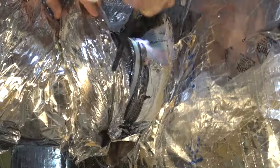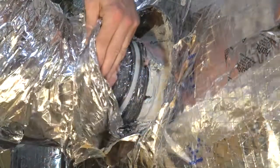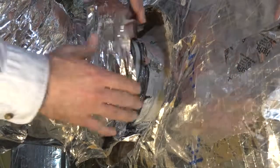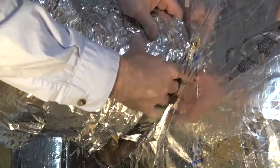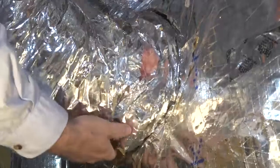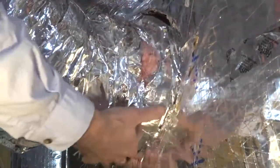If you find joints or connections that have not been sealed, you can leave those spots exposed for easy access for repair and let the HVAC contractor put the insulation layer back together. If you confirm that all the connections between the supply plenum, takeoff collar, and flex duct have been sealed with bucket mastic, you can then put the insulation layer back together like you found it.